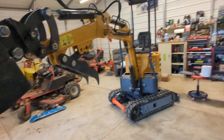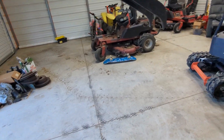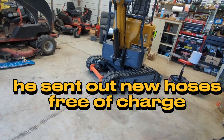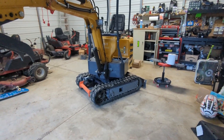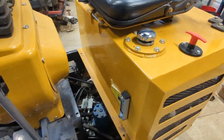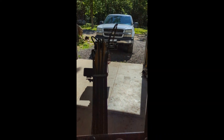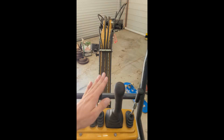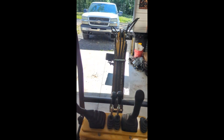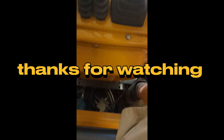Supposedly you're supposed to be able to push the bucket with it out. Maybe there's air in it, let me fiddle with this some more. This is at six and a half turns out - seems perfect. At seven turns out it was kind of down on power - night and day difference.